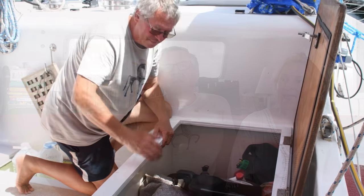Well, all the typical building methods that you cover here have their pros and cons. Like steel rusts, but steel is an honest material, as they say. You see where there is trouble. Now, with aluminum, you don't see the trouble until it's corroded through. But you have seen the aluminum flourishes, the little bubbles, etc. And you cannot really control that.